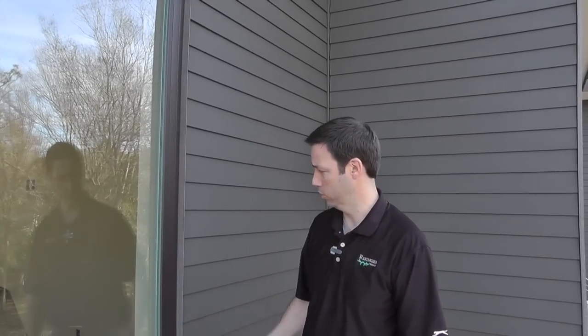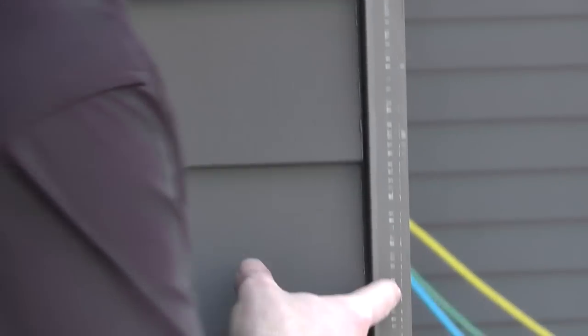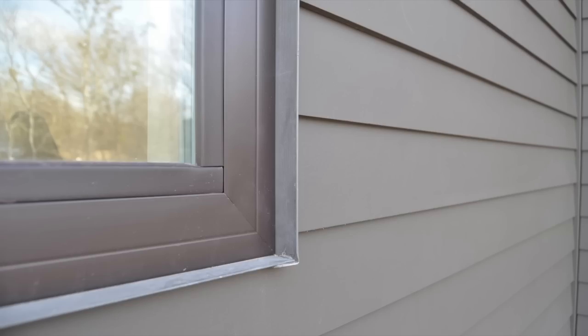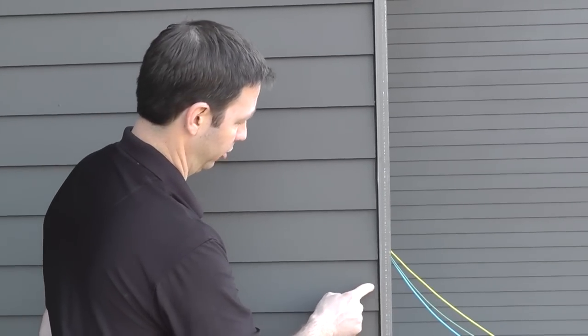The beauty of this is even though our siding is proud of the window, that flashing that we made really gives us the ability to come up to that and not see it. If you zoom over here, we can show you. We did an outside corner piece as well. This is an X-Brace. And if you kind of sight down the wall, you can see how that flashing piece sticks proud of the hardy plank by about three-quarters of an inch. Once I do this system where all my weatherization is behind there, this cladding is really only acting as my UV protector and a little bit of bulk water shedding. Other than that, I could care less if some water gets back there because we're 100% waterproof and we want that water to come out. So caulking is really unnecessary. You can see we did not caulk this gap between our flashing and the hardy plank.